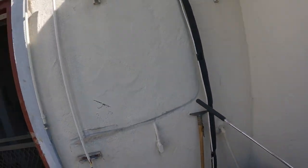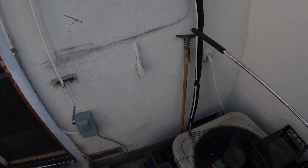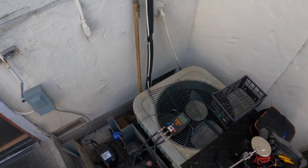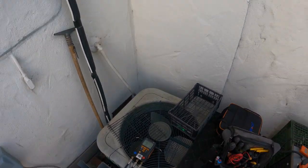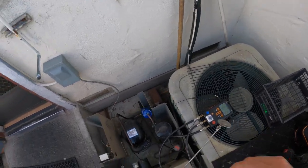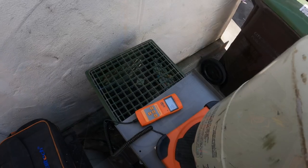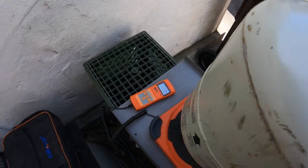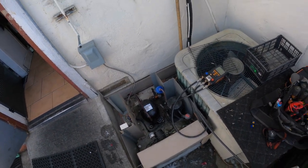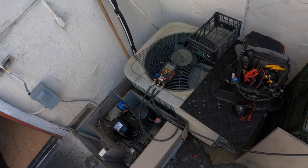Now, the replacement coil, I ordered it with the 448 TXV, and we're going to do the thermostat with defrost, the A421 ABD02C thermostat. So I like building up the little coils. Total charge came out to about 4.85 pounds. It's about right for that size receiver and everything. And I'm still letting the superheat adjust here.